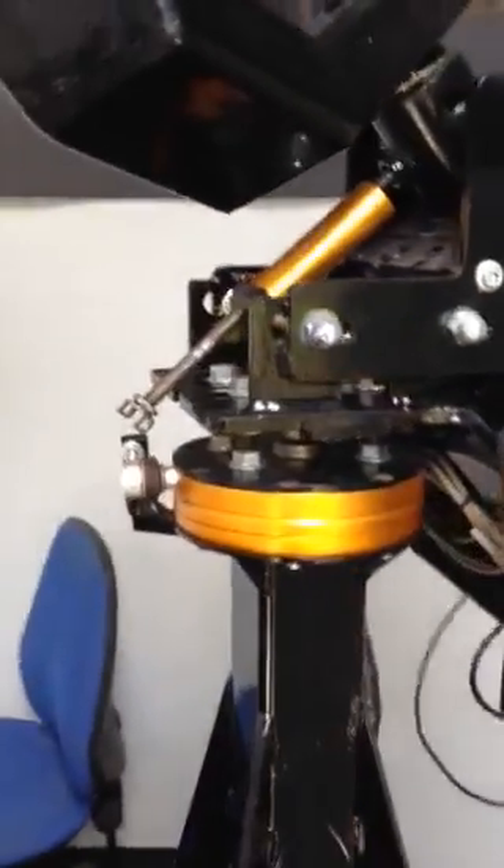The mount is all hand-built. It uses all the electrics from a Celestron SLT mount with uprated motors, Pitman motors and 255 tooth worm gears. All the cabling goes through the main axis so there's no cable wrap issues. Same for the dec axis, all the cabling comes through there.